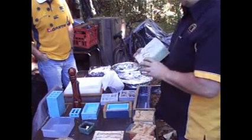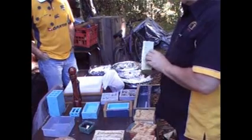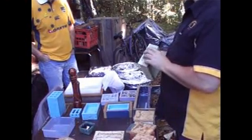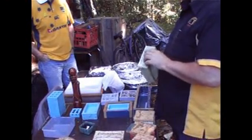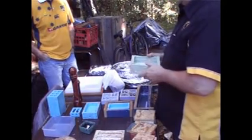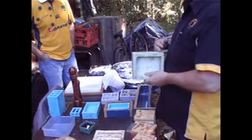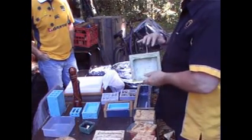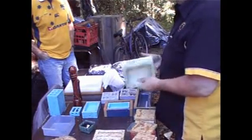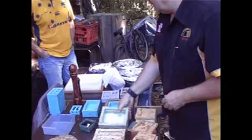The other problem I had with this old mould is that I actually cooked it because it was taking so long to go off, and the silicone boiled. So lesson number one, don't try and post cure your silicone, it doesn't work. But I then sliced up the boiled silicone, cast it with other silicone, and it's then all joined together and recast. You can use scrap silicone.